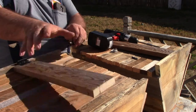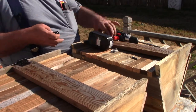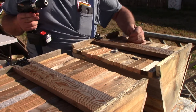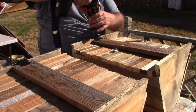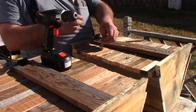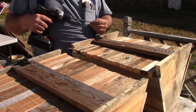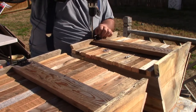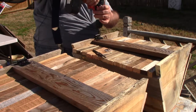They weren't expensive, probably less than a dollar a set. So we got this first one in. That actually locks that in place pretty well. It's not perfect, but I can make do. Nothing's ever actually perfect. We got this first pilot hole drilled. Little screws out. Just kind of locks the hinge into place so that when I drill the rest of the holes, it doesn't move.